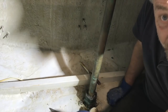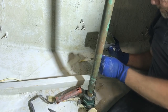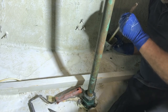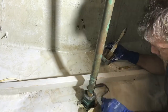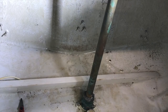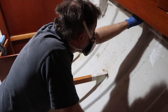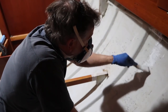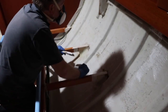I need to reinforce something. Just inside the stern locker, behind the rudder axis, I found some bad fiberglass area. I don't like to leave it as original, so I prefer to use some fiber and epoxy to finish it. And for the last part of the day: painting the starboard side with the primer.